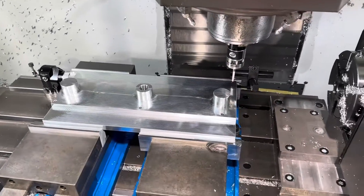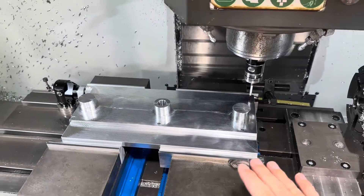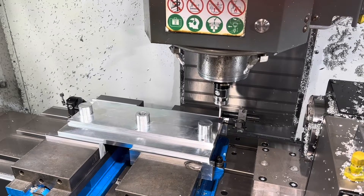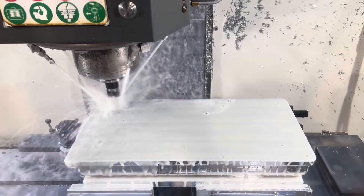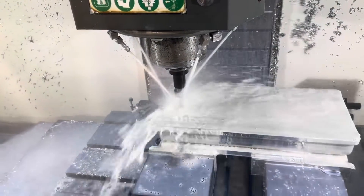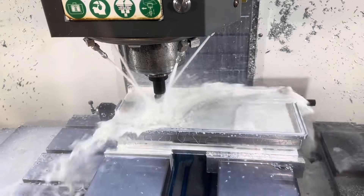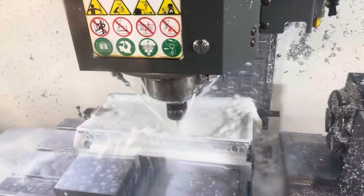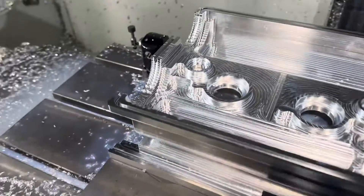After probing the bore, I set my Z position using the top surface of the valve cover as Z-zero. The second operation — the bottom of the valve cover — starts by facing, and then I cut the groove for the gasket using a very small 1/8" flat end mill. The next tool is a 3/8" flat end mill to rough out the inside. I used the 3/8" instead of the 1/2" because all of the internal corners of the valve cover were designed around the 3/8" end mill — a 1/2" would have left fillets too large and caused clearance issues.